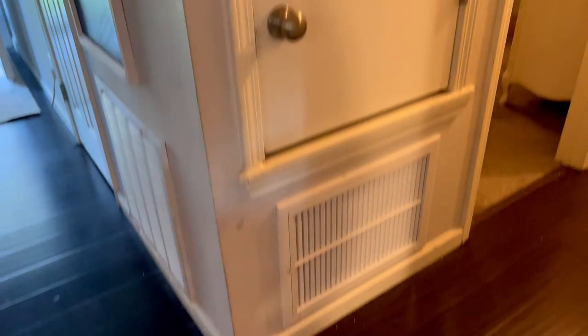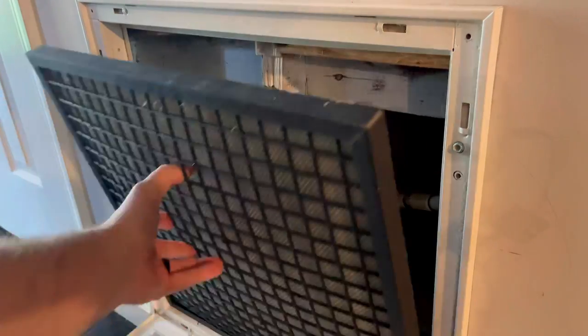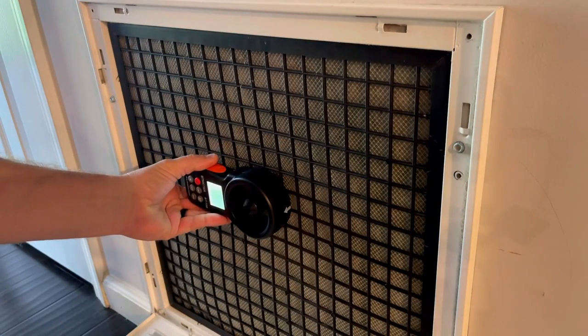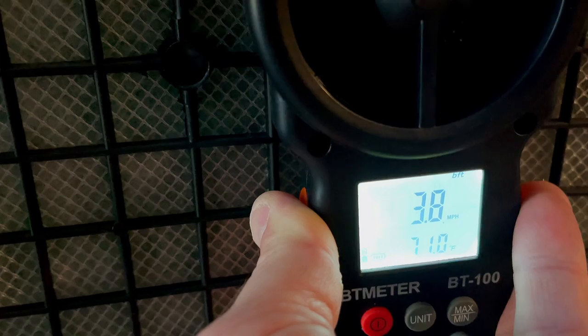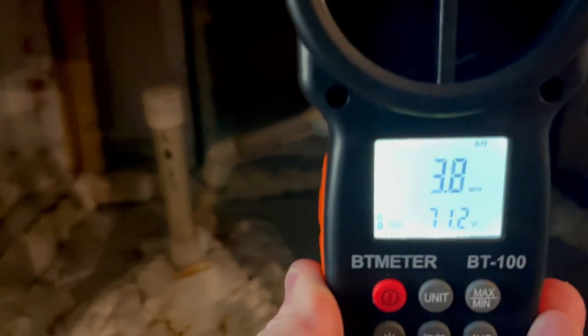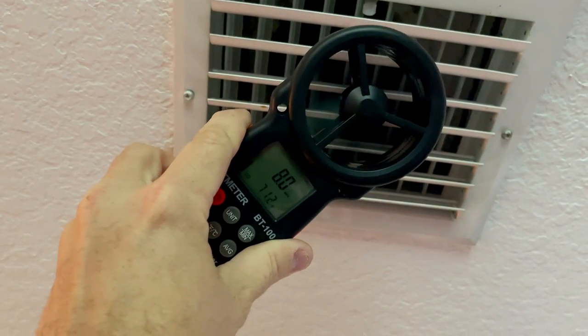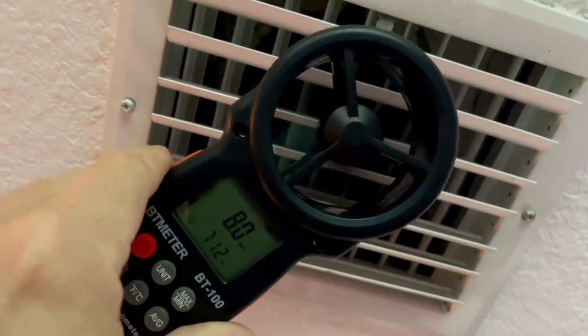Welcome to the humble abode. Inside this little half door is the air handler, with two intakes that both have filters of different sizes. We have washable filters installed here — these are around MERV-8 as well. The anemometer will spin the other way on this intake, but we'll stay consistent and get the results. With the filter in place, we've got about 4 miles an hour at maximum airflow. With the filter removed: almost 5 miles an hour. About 30 feet away at the living room air vent, we're averaging about 8 miles an hour with the filter and about 9 miles an hour without.